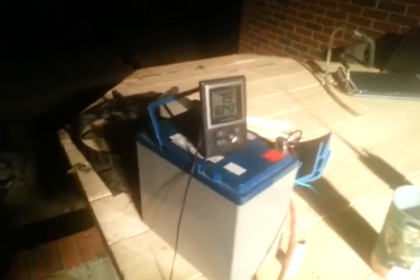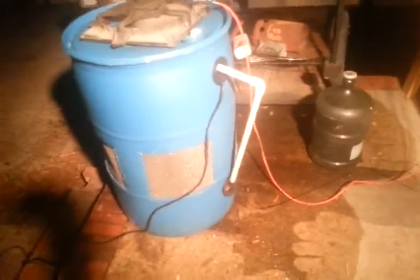Even as horribly inefficient as this thing is — the piping in there is only splashing water on one section, and the other sections aren't getting saturated, it's just sucking air in from multiple places — through the evaporation process it's still causing the temperature to drop. I'm reasonably impressed that it dropped the water temperature six degrees. And look at that, it just dropped to 79 degrees.